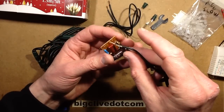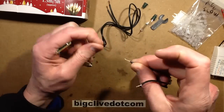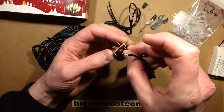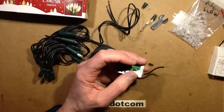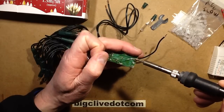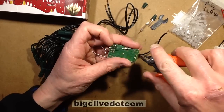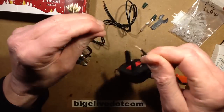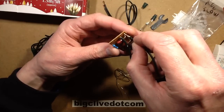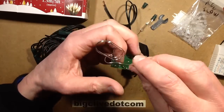So to start with I'm sticking this lead in here. Is this going to fit in easily, or is it going to scrunch all the strands up as sometimes happens? I think it's going to try and scrunch all the strands up. So let's stuff that through that hole — actually I'll solder that now before it pops out again. You can hear the soldering iron cycling on and off in the background, making its characteristic little buzzing noise. In with the other mains connection, noting to get it on the correct side going to the rectifier via the capacitor. Don't want to get it on the wrong side — that would be a wee bit dramatic. What would happen? That would be basically across an electrolytic capacitor — that would be thrilling.